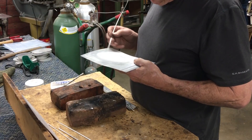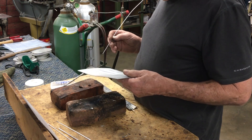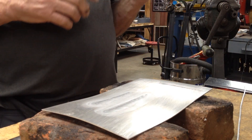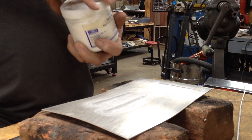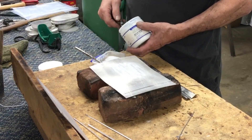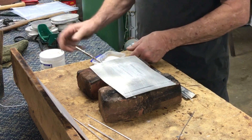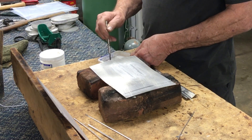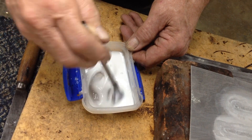I'm going to go out on a limb here and say I've had this flux for over five years and I didn't take particular care when I was mixing it up. I'm going to try something before we do another weld — put some more flux powder in there and make it a heavier mix. Sometimes that makes the difference. Clean metal, fresh flux, clean rod. I didn't clean the rod either, so there's probably some residue of oil and dirt that came from the shear. All those things are to be avoided.